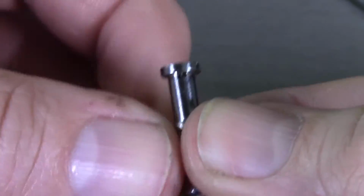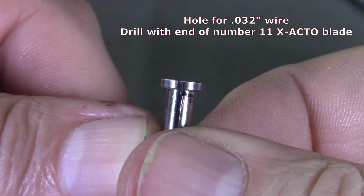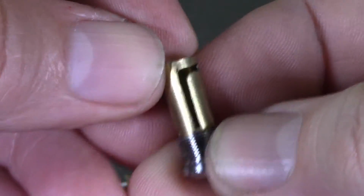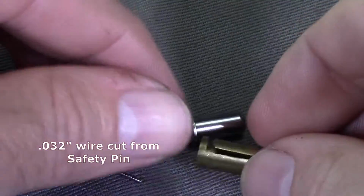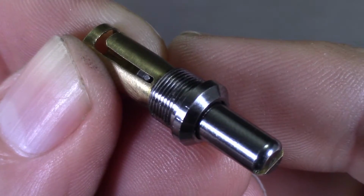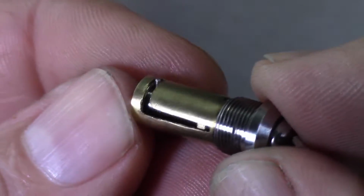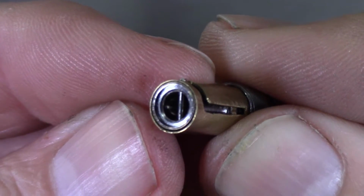A further modification keeps the button in proper alignment for immediate pressing and limits its rotation to 90 degrees, a form of bolt action, if you will. I recommend this modification if you have the tools to do it, as it greatly enhances the pen experience. Take care with the alignment of the slot, as it needs to guide the flats on the button between the dimples and limit the rotation to 90 degrees. Also note that the pen should just guide the button in its travel and not take an actual load.